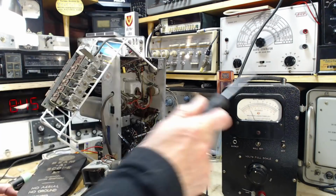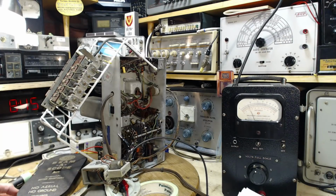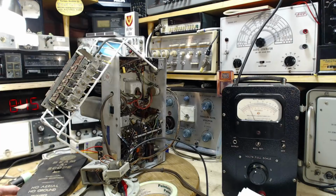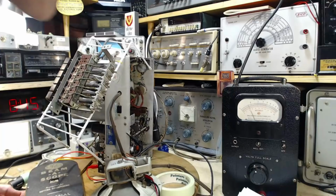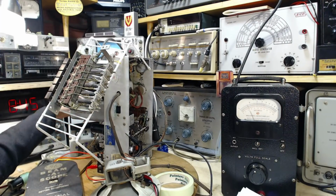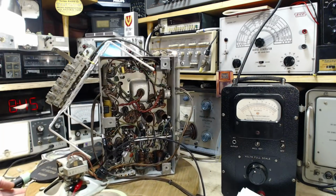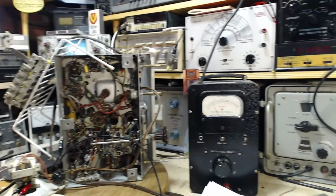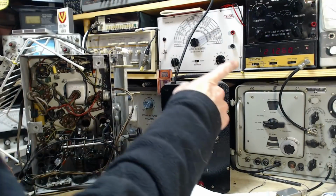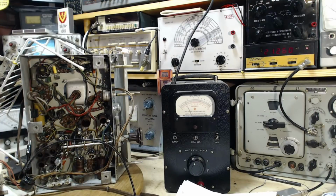So the right thing is the radio must be tuned to the right percentage. I got it in my head that this was not an oscillator adjustment. That's what happened to me. 162. Okay, it's right on 162. So that should be picking up 21.5 megacycles, but it's actually picking up 21,260. And that's because I've knocked this oscillator control way off.